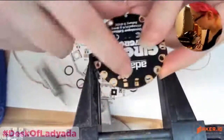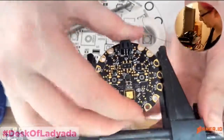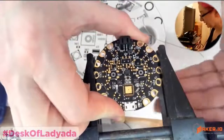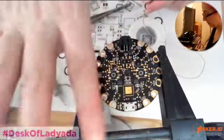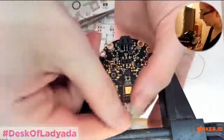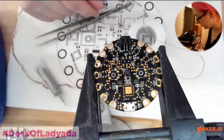Right, so the PCB has through-hole slots, and slots don't cost anything. You just have to figure out how to get your PCB house to make them, but once they make them, this fits in very nicely. It sits in place, and you don't need location bumps, which sometimes, if you're doing all surface mount, you have a location bump to keep it mechanically centered. Most devices that have only surface mount pads, the enclosure provides strain relief, but honestly, I would still go with through-hole. Half through hole, half surface mount, if you can.